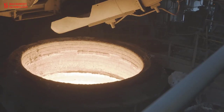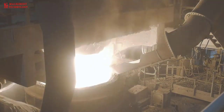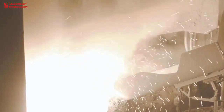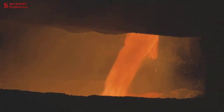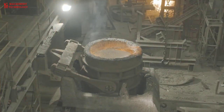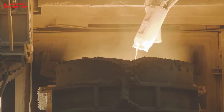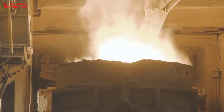Here the liquid steel is refined with bulk alloy additions that are stirred into the steel bath using the activity caused from the chemical reactions of the melting process. The liquid steel is then tapped into a ladle and covered with an engineered synthetic slag to prevent oxidation. At the ladle refining station, further alloy additions are made to bring the steel chemistry close to customer specification for alloy content and DI requirements.